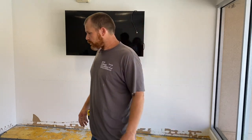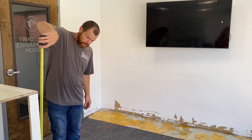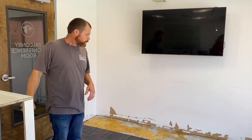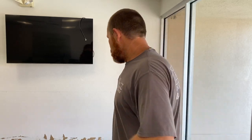So, let's move forward. Check, make sure 43. So we got three cabinets here, and the idea is we want our filler distances on each side to be the same. Now, if you're not with me on what a filler is yet, don't worry, we'll go over that. It's pretty simple. Filler fills in the space that's not filled in with cabinets.